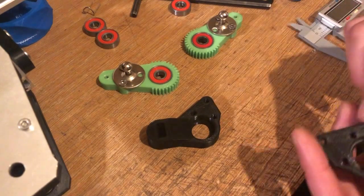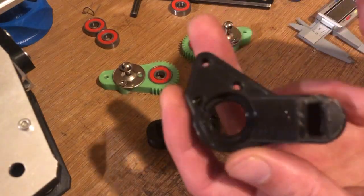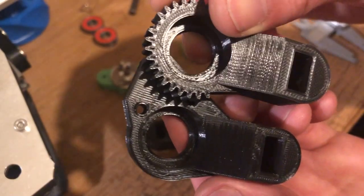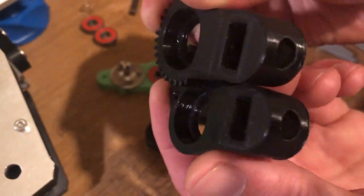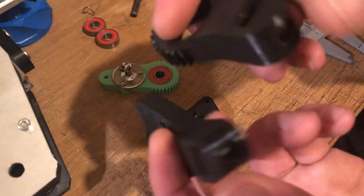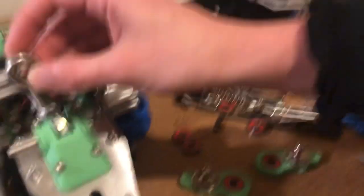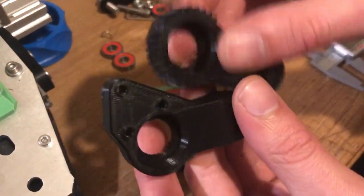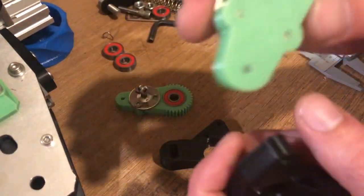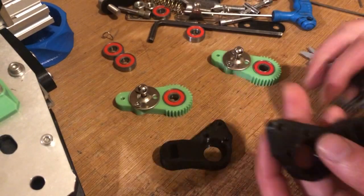The parts are done, and here they are. So this is the old bit and this is the new one. This half is mostly exactly the same - we've got a space for a nut to go in, and an M8 bolt that goes in through this hole, and that secures it onto the eye loop thing. The new part has got three bolts here, which match the three holes on the bottom of these links. So we're just going to be taking these parts off and sticking them straight onto here.